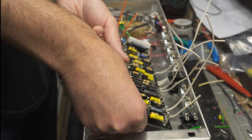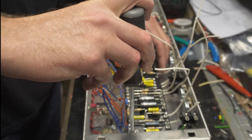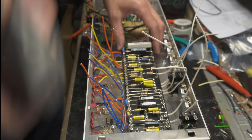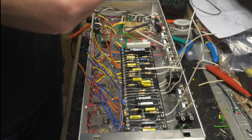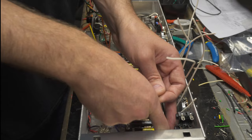I'm trying to be as gentle as I can with these wires just to make sure I don't break anything, and the screw will just screw right down into the chassis. Another nice thing about the Trinity chassis is that a lot of the things that screw and attach to it — all the holes are threaded into the chassis, so it just screws right in. You don't have to worry about having nuts on there and more pieces and things coming loose. I'm going to get these all put in and I'll probably have to move some wires around and clean things up a little bit with the wiring before I start trimming them and soldering them into place.